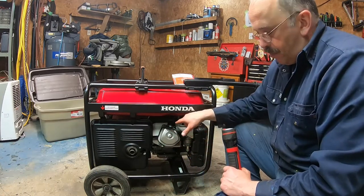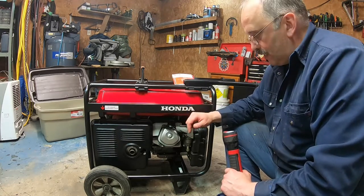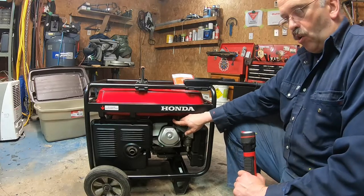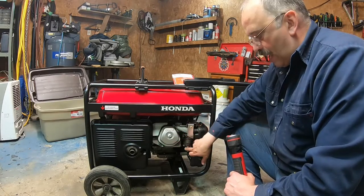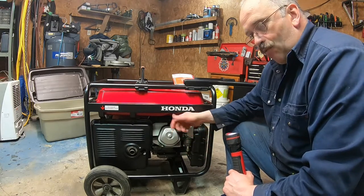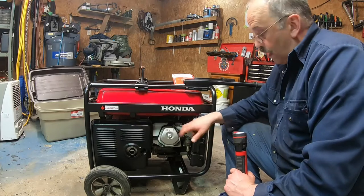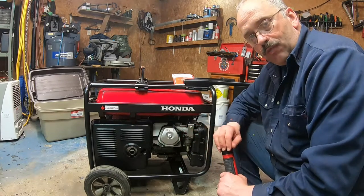All right. Then I put back, of course, I already put back the spark plug. I already tightened it. And then you just put the cover on like so. And it's really easy to do. So just a quick recap. After I'm done, I close the valve. I flush the gas. And then I remove the spark plug, put two tablespoons of oil, I pull it, and then I reinstall the spark plug and I stop to lock the chamber with the valve, all right?